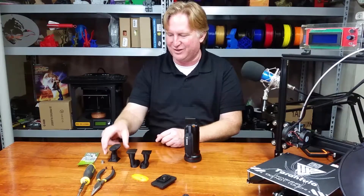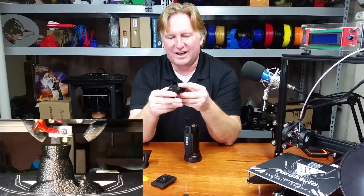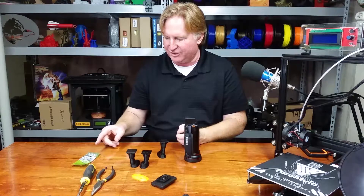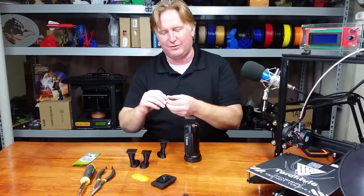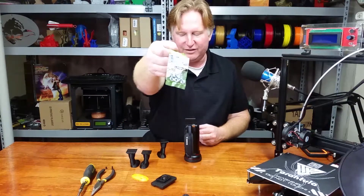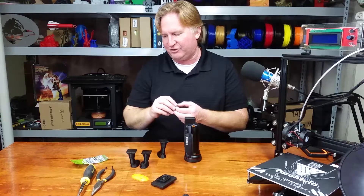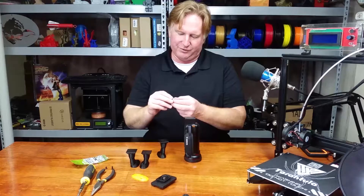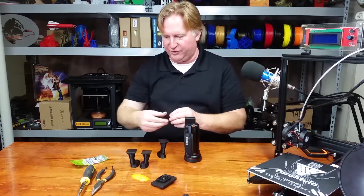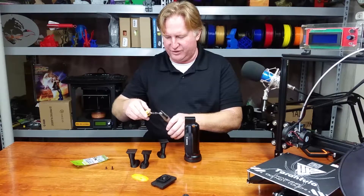So the next thing I've done is I've created this one — this just barely came off the printer. I resized it so I believe the screw will fit into it. The only thing is I did notice the screws are too long for what I need. So I had to take one of the screws, put the nut on it — because this bag comes with screws and nuts, which I got from Lowe's. These are the half-inch screws; they don't have anything shorter than that, which is unfortunate. So I just put the nut on and ground it down flush with the nut. I think that's going to make it where I should be able to attach it to the camera.